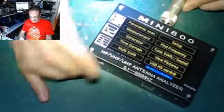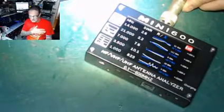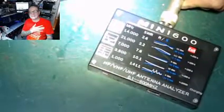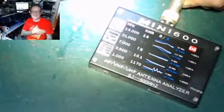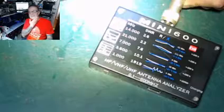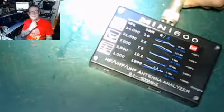Didn't like me switching over antennas while it was working, I think. But anyway, it's back. And we go multi SWR, and this is on the beam this time, as you can tell by looking at the SWR on 40, 80 and top band. Could do with tuning my beam in a little bit by the looks of it, although it doesn't seem to show that bad up on the tuning. But anyway, that's the gizmo, right?